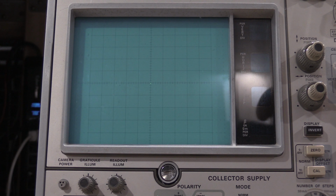And if you have any doubt that you're adjusting the wrong potentiometer, because there's so many in one of these instruments, triple check it. You do not want to just have your tuning tool in the wrong pot and tweak one you did in the very beginning and have to start all over again.